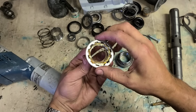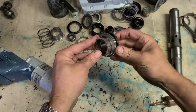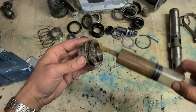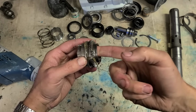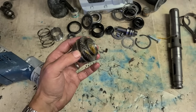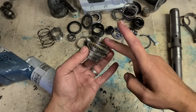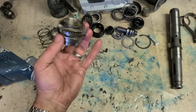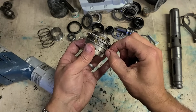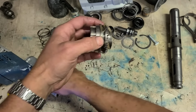A little shim sits inside of here as well. Keep them all sandwiched together. There's normally the Bosch white grease that goes onto this, but I just use this heavier gear grease for initial setup. I could stop spilling it everywhere. You don't have to use that, that's just what I prefer to use myself. Stick it all together with this slider all the way up, so it's holding the shim in the center, so it's not dropping down.